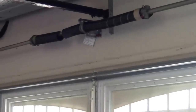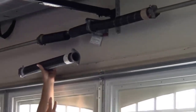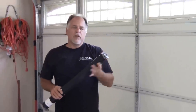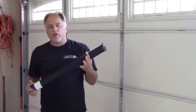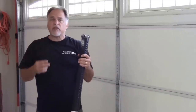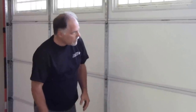You can't just put a thicker steel spring of the same length, because it would be too strong for the door's weight. By taking a thicker steel and extending the spring out longer, you notice this is a substantially longer spring than the one that was there before. Because it's longer it doesn't lift as much per turn, but it's thicker steel — so they balance each other out. This spring has been calculated specifically to give around 30,000 cycles of use before it is scheduled to break.